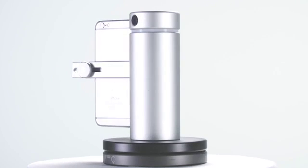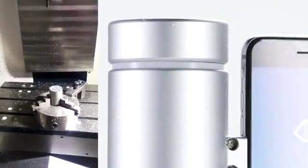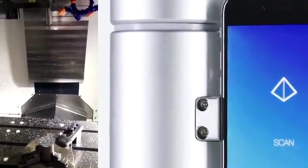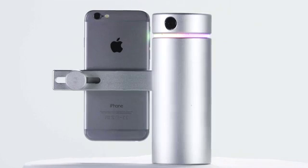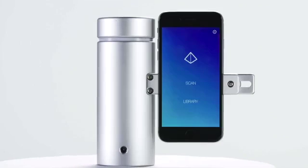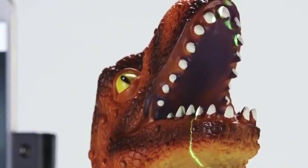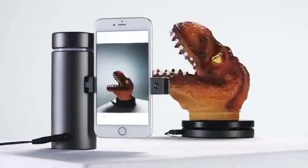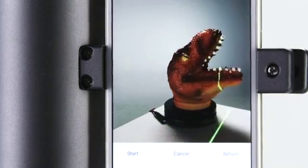All that's possible thanks to a design that's both beautiful and functional. Machined from a solid block of aluminium with over 35 milling operations, we've designed it to be both robust and precise. The light ring gives you quick visual feedback and the adjustable knob lets you secure any modern smartphone. The green laser lets you scan in any lighting conditions, as most cameras are twice as sensitive to green than any other color. For full 360° models, we also designed a Bluetooth turntable that will sync to your scanner and rotate your object to make sure you get every angle.